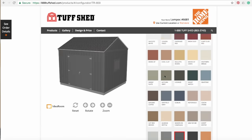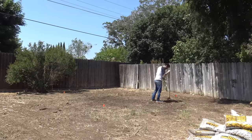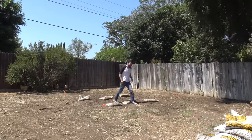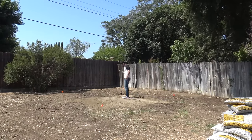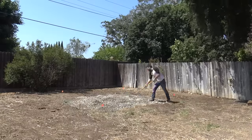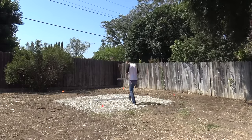I selected a nice gray monochromatic shed about 10 feet by 12 feet in size. After checking local building code, I picked a spot in the yard and packed down the dirt before spreading about two inches of sand. I used my tamper to pack down the sand and then added about three inches of gravel over the sand. I used a long straight board and a level to check and make sure that the gravel was flat.